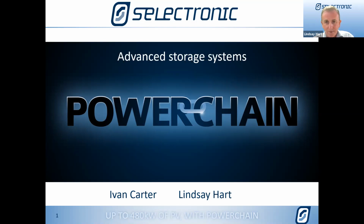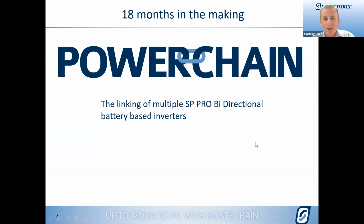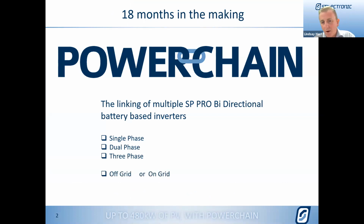Let's get into this very exciting subject of Powerchain. What is Powerchain? Powerchain is the linking of multiple SP Pro bidirectional inverters, bringing together a number of battery-based inverters, the SP Pro. We are making an assumption today that most of you will be familiar with the SP Pro product. We can use this linking of multiple inverters in a single-phase system, in a dual-phase system, or in a three-phase system. We don't really mind whether it's off-grid or on-grid. The same concepts are going to apply.